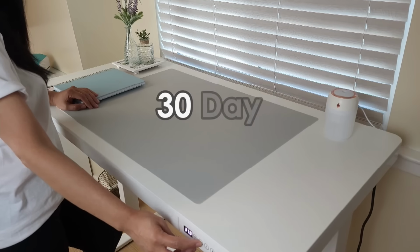Then I paint the paint stir sticks white with Waverly chalk paint. I do about a couple coats, but I will be sanding this down as well. I apply the paint on the top surface. You can also do the bottom and the ends, but I do avoid the edges or the sides because I will be applying glue on those areas. I want to distress the wood, so once the paint has completely dried, I start sanding.